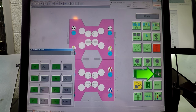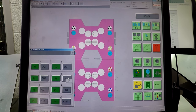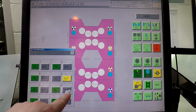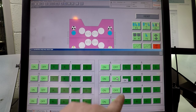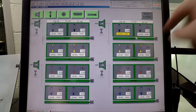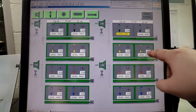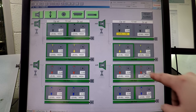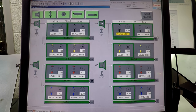Back on the tower screen, if you click on the button that looks like a vice grip, that is the ink train clutch. If you notice there's going to be no color on one side of a unit, you can turn that clutch off so it doesn't wear out — go to the blue, red, and yellow levels and hit the out button, then okay. If you do that, you will also need to do that with the water and the color flow modules. The water is right next to it — it's called the dampening page pack selection, just hit off for those couples, and do the same for the color flows. When looking at a layout and setting up your pages, make sure you only have the color flows on for the pages that require them. It will save on wear and tear and prevent you from putting an ink mixture into non-running modules that you'll have to deal with next time.